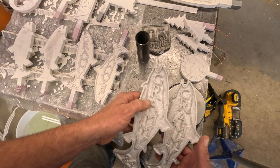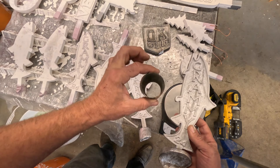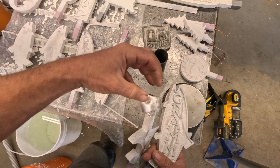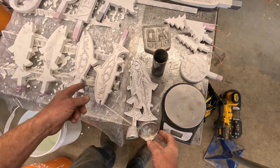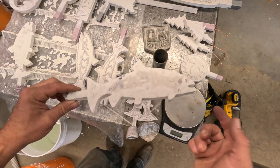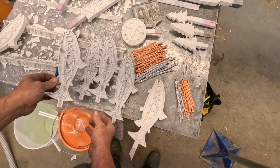The second one came out really clean too — very little oxidization. For the second one I ended up switching to this pipe for a pouring basin instead of a tin can, just to try and shrink this and get a little more head pressure. I got a couple more ready to go and I poured two more off camera — they came out good.